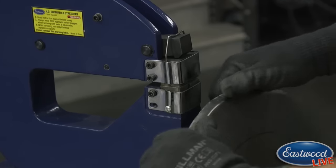So I did a little over half there and it's starting to come around. The key to using that sharp dolly - you can see this line up here is really nice and crisp. If I was using a dolly with more of a rounded edge it would have really rounded this edge over and started getting out of shape below, which we don't want. Got a nice crisp edge there. Since we're not fully folded over completely, if I need to adjust something I can pull it back up a little bit and hit it with the shrinker. In here it's a little rippled - so what I'm going to do before the final folding is go through with the shrinker and just kiss those whole areas with the very edge of the shrinker to smooth them out before hammering them over. That's the correct way to do that.